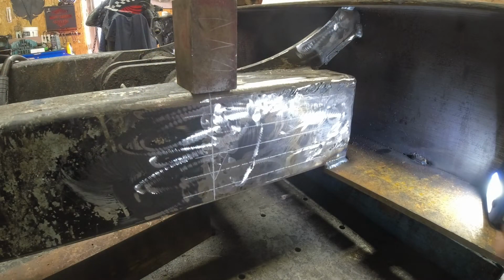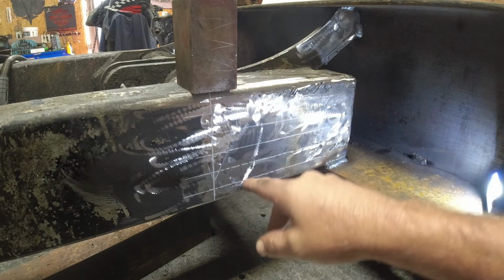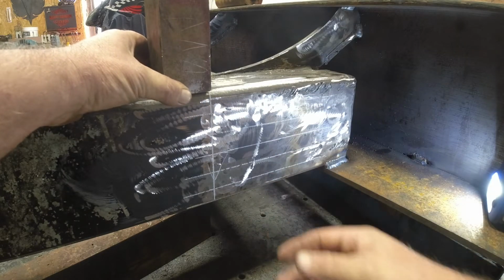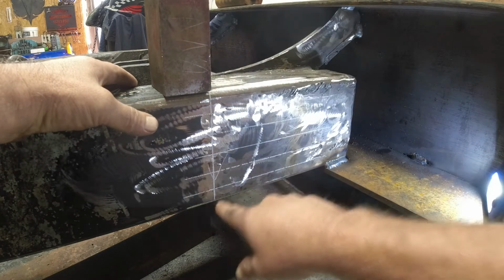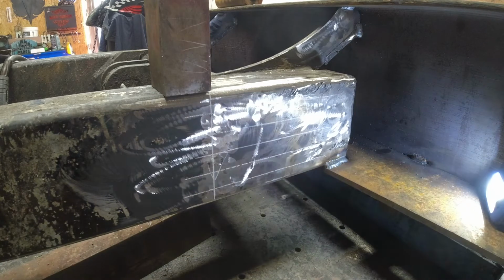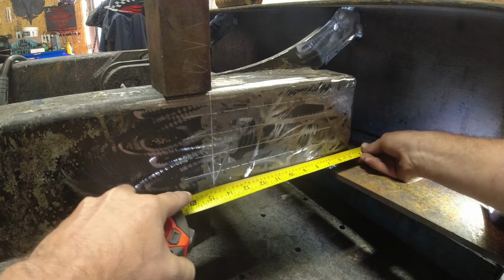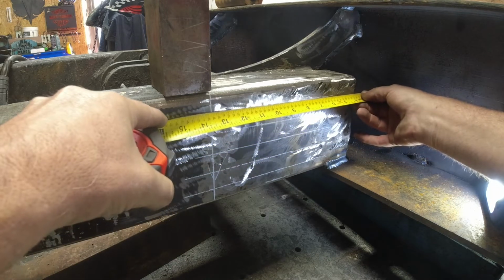Okay, I got a lot of the radius laid out for how I'm going to measure it. What I did was, this is a 6-inch tube. I need to go from here to here, so I have a square block that I also laid out. I have this chunk for this straight edge line, and I put 1-inch marks all the way up, and then I'd measure from the bottom of the 6-inch tube all the way back from the blade to my line, and then I'd move up every inch, and I'd get all those measurements off the radius.